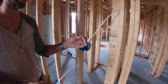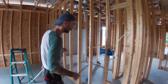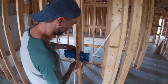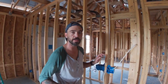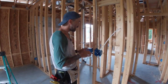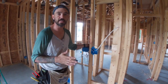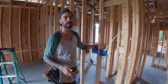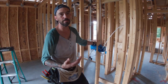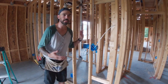I kind of messed up this end trying to pull it out, so I'm just going to clip it off so I don't have a hard time taking the sheathing off when I go to cut in. We've got a three-gang box here, still staying on the end side. Some inspectors want to give you a hard time about stressing these tabs — my inspector doesn't care. You can have two wires under one tab; it's not a big deal in the area I'm at, but I have been in areas where they don't want more than one wire under each tab.